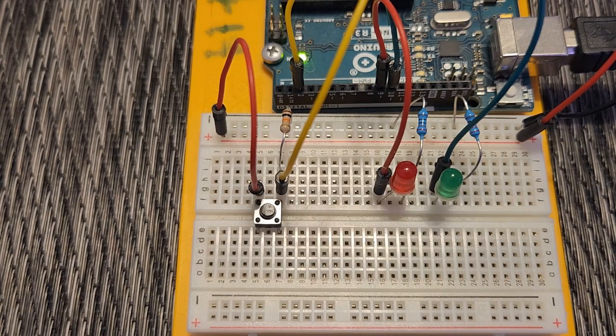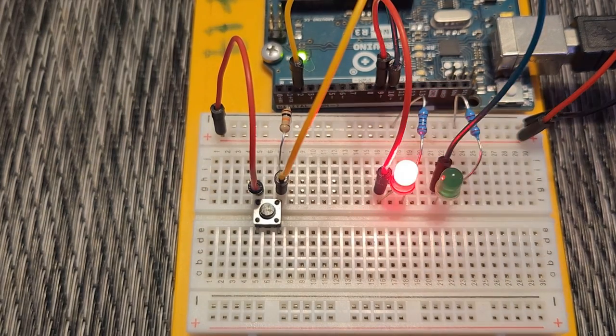Because the button isn't continuously pressed, once that cycle is done it goes back to the if statement — switch is low, LEDs are off — and you can press it again and again. From this knowledge you can do so much more: add more LEDs, have them fade, attach it to a speaker or an LCD screen. Take this with you, play around, practice, and see what fun stuff you can come up with. Thanks for watching — if you like what you see, like the video, subscribe to the channel, and follow us on Instagram.